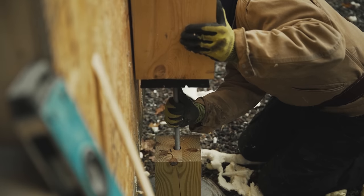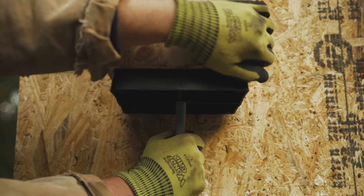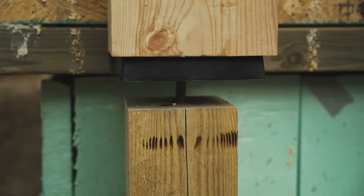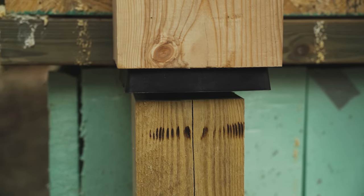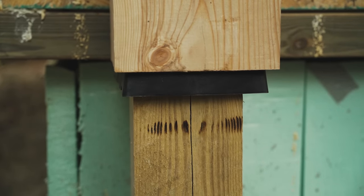Those pressure-treated blocks will end up being completely concealed. The framing for the floor system will encapsulate those 6x6s, and then, of course, the decking gets put down on top of it, so they won't be visible in the finished product. What you'll see, though, is that composite standoff base, and then, of course, the timber springing off of that.